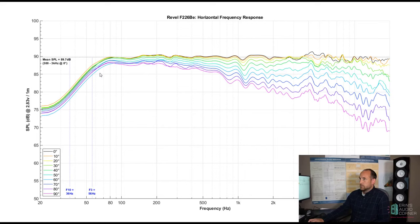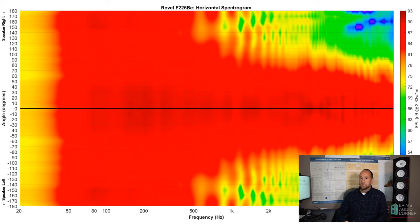Now let's talk about what happens off-axis. So as you move around the speaker to the side, you can see that the trend of the response actually follows pretty well to the on-axis response, other than what I'm seeing here in the 4 kilohertz region, as well as the 6 kilohertz region, which look like some mild resonance. And I do say mild because even though there is some peaking there, it's subdued pretty well. And in the spinorama data, which we'll get to shortly, there's no real evidence of resonance there in that region any longer.